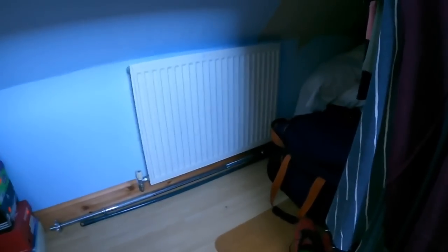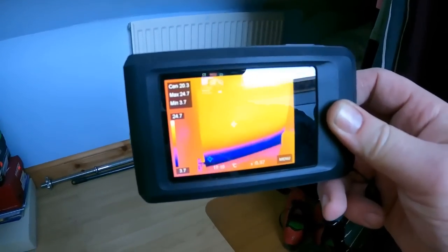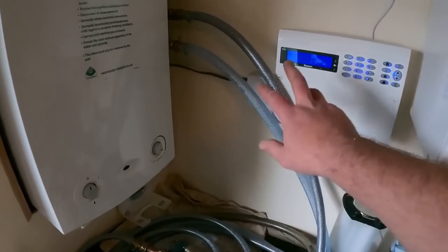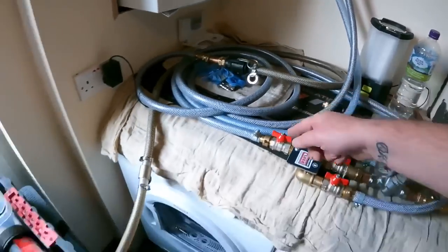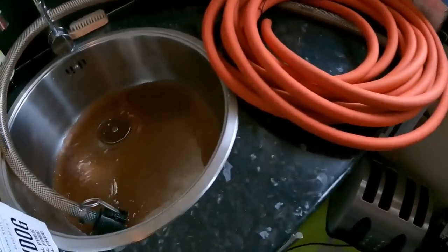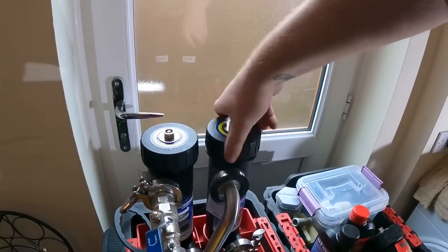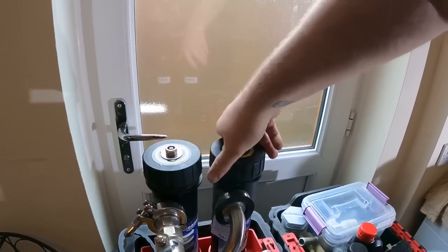So now the whole of the Thoroughflush kit is flushing cold water through this rad, and you can see it's beginning to build up from the bottom. We've now shifted the rads downstairs, and we've opened one of the rads up downstairs, and you can see how black this hose is now, again running through here, and that's what's coming out. This is what has come out through the dumper side of the Thoroughflush.